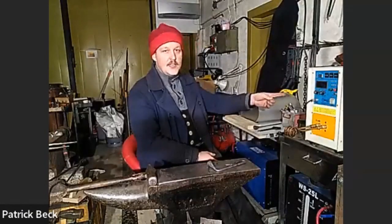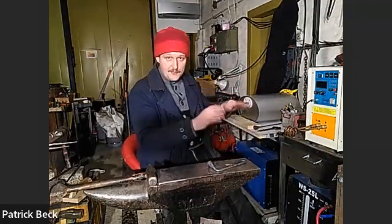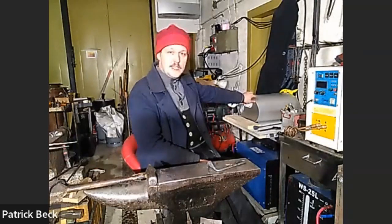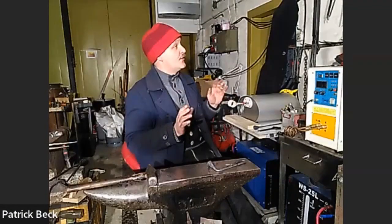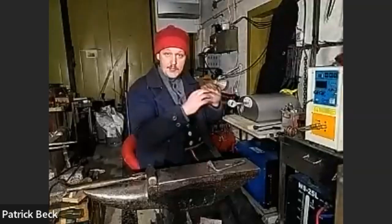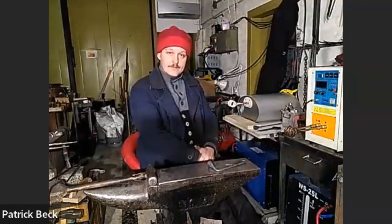Paul asks about the electrical connections. This Chinese machine is single phase and has a normal Schuko plug, like a lamp. The French machine is three-phase. Both have 16A fuses. The Schuko draws around 10 amps. My workshop was previously a cow shed and then a mechanic's workshop, so they invested in 2.5mm cables - a bit thicker wiring than normal.